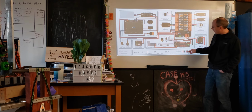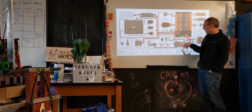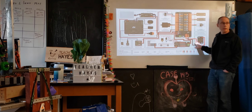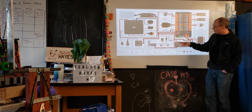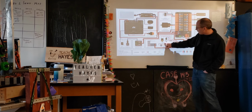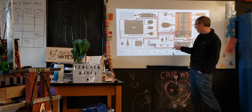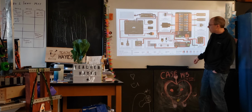So you have power coming off here to power the pneumatic hub. That actually then converts this voltage in some cases to other voltages. What you have coming out of here is all 12 volts based upon the battery that's driving this. Sometimes there'll be a voltage converter here. I don't remember if these are powered differently. But then this is actually powering something else following that. If you remember, we had a compressor as well as I think there was a relay here. But this is sort of a whole subsystem that they design separately.